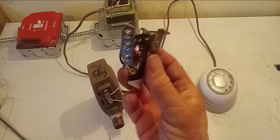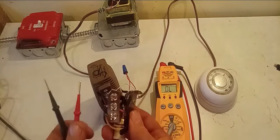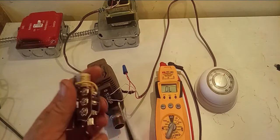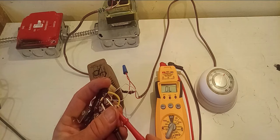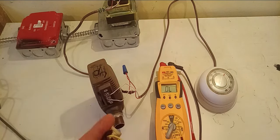This old internals here — I ripped this out of a zone valve because it wasn't working, specifically for this purpose. When I test between terminals one and two on this, as you can see, I have no continuity there. So the zone valve head was bad and it needed a new zone valve.